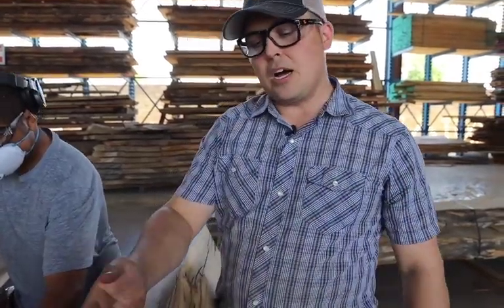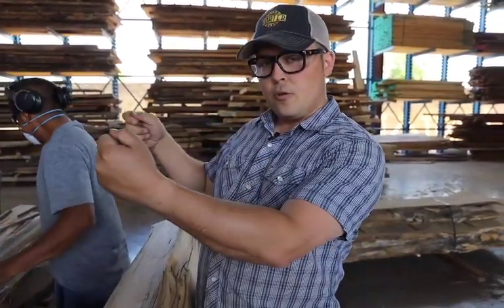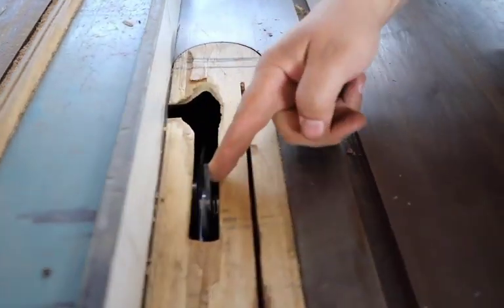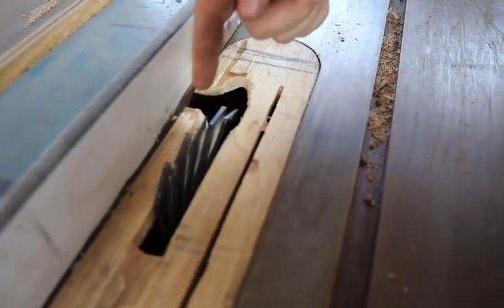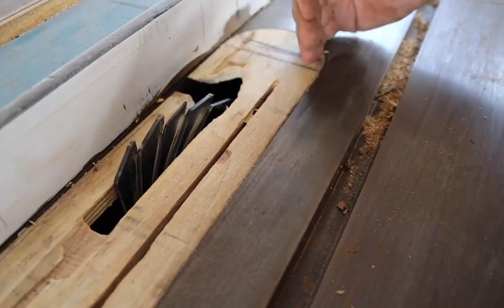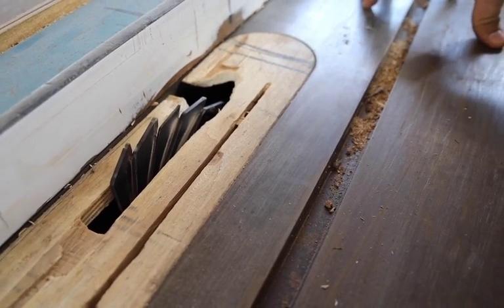What we're going to do is take a pocket — this pocket's going to be about three quarters of an inch deep. That's going to allow us to put a piece of wood in there which we call a French cleat. It's got a 45-degree angle, and we put the other 45-degree piece on the wall. When you hang your mantle you just let gravity do it and it'll suck into the wall. In order to make this flush we're going to have to dado out this pocket. A dado blade is different from a regular saw blade — it's multiple blades stacked together. This big giant gnarly dado blade spins around, all these different blades take a big chunk out, and we move the fence back each time to take more chunks until we have this really nice big dado out of the back.